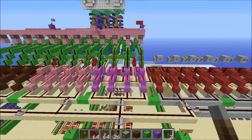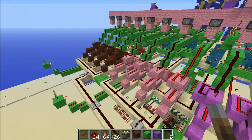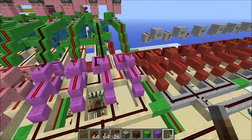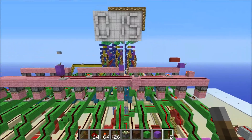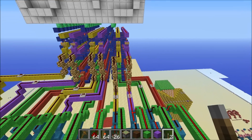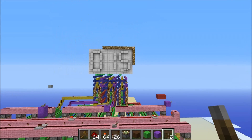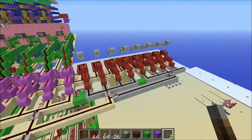Right now you can see 15 displayed on there. These columns are four wide — think of this as separate decoders all next to each other. This is 1, 2, 4, and 8; 1, 2, 4, 8; 1, 2, 4, 8 — all leading into these decoders which are just binary to 7-segment. These go 1, 2, 4, and 8 and they display 0 to 9.